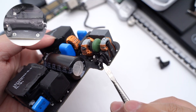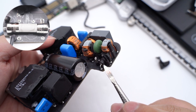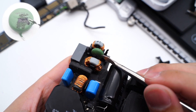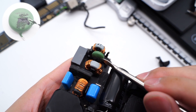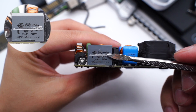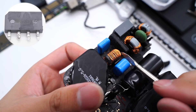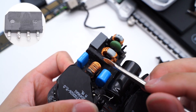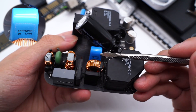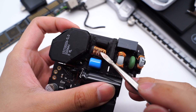Here we go. This is the tubular fuse protected by an insulating tube — rated current is 4A. Two common-mode chokes are above the fuse, used to filter out EMI interference. The varistor is used for input overvoltage protection. The gray cube is a safety X capacitor, 0.33μF. The scar was accidentally left when we cut the case. Here is the GBL10 bridge rectifier. The blue filter capacitor is marked FPS2W105. Another blue filter capacitor is at the center of the PCB, and there is also a filter inductor between the two filter capacitors.